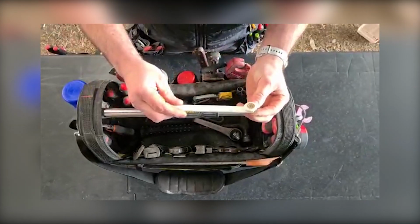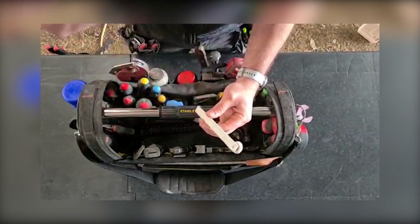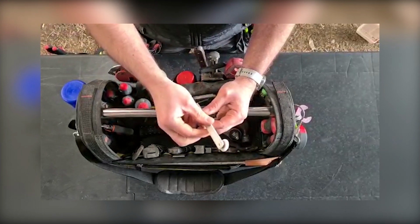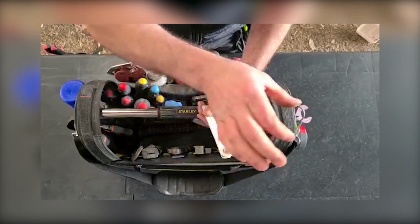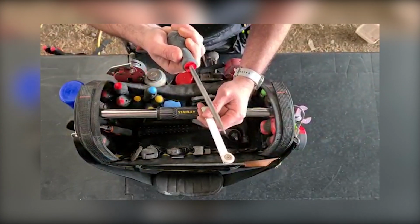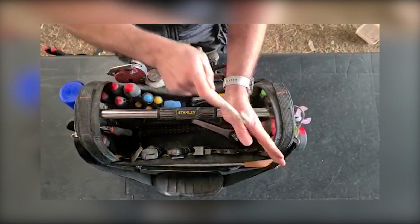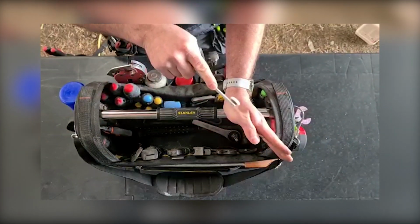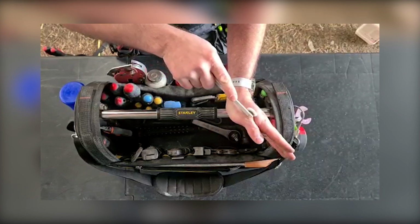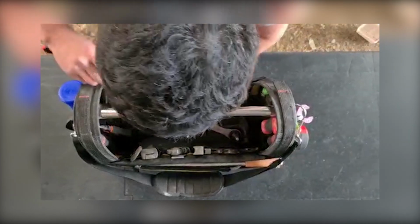This little tool here, I've had this for a few years now, you guys might be familiar with it, but we got it with a shower. It was fitting a very bespoke nice shower, and it was a big sheet of glass, and you'll have seen when you fit them you have to put a long rubber seal in. Usually I've done it in the past with a screwdriver, no good because you can mark the shower, it ends up being a nightmare. This makes it easy, literally putting the shower screen in, put your rubber seal in, just roll it along, push it in, and that pushes it all the way. Again, no damage, so just little tools we picked up over the years.